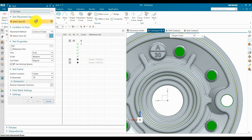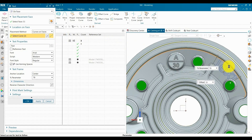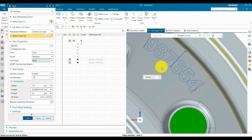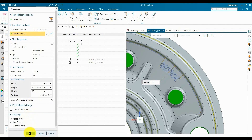Now we are going to define the text — the engraving text. For example, first we choose to define the part number. We use the text command: planar text on face, and define the curve for placement. We choose the center to define the placement. We can also define the offset from the curve and the size of the text. In this case we choose 3.5, and the text we write is 8987654. This is only for example. You can also change the font and press OK.